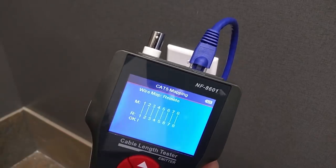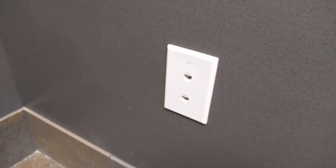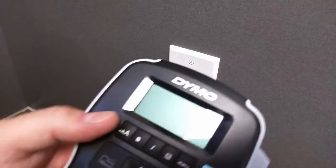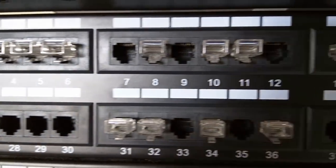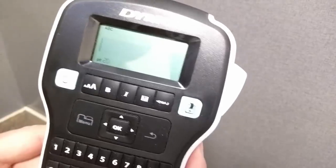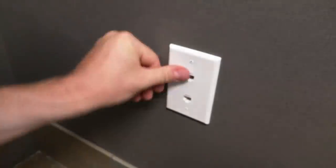Once you think you have the port on the panel, plug an Ethernet cable into the remote cable tester and the other end to the port on the patch panel where your tone receiver found the tone. Then go back to your main tester unit at the wall plate and set it to test the cable — called wire mapping on this tester. This is done for two reasons: one, to confirm that is the correct port, and two, to make sure it is wired correctly. The tester will show you a map of the cable and indicate if a wire isn't terminated correctly. If the wire was wrong, I would start by re-terminating the wall plate keystone and then the patch panel if needed. If the test came back empty or failed, that's probably not the correct port and you could re-tone it or try adjacent ports. Since this is the port and the connection is good, we can label it. Optionally, you could place un-terminated jacks into port 29 on the patch panel to help track which ones you've already identified, letting you know which ones to skip. I labeled this jack T29 — the T differentiates between the top and bottom patch panels.